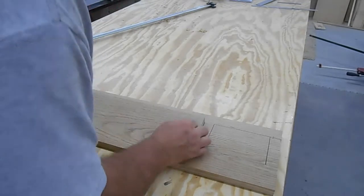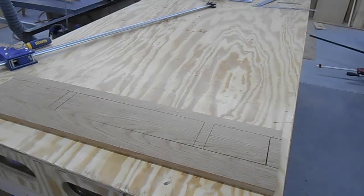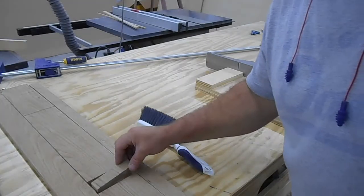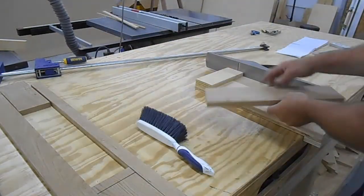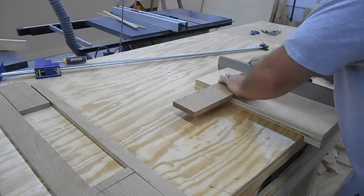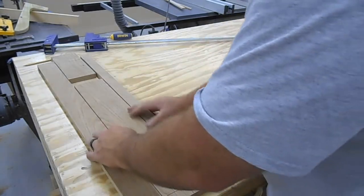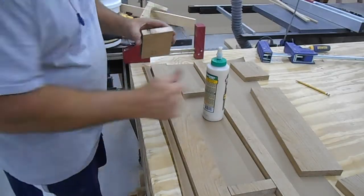And then the pieces are reassembled at the bench. And here's this piece laid back out just like it came apart. And then one by one I took each piece out of its position, and using a shooting board and a plane, I squared up all 4 sides of each piece. And then it's time to reassemble the drawer frame.